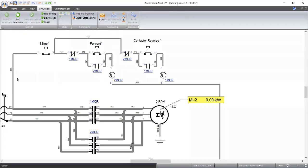So let's start now. Let me on my breaker, then forward, then energize. You can see it's jumping to 40 something before stabilizing on 3. So now let me increase the load on the motor. The torque on the motor. The torque is the load actually. Let me increase. It's on 1.6 for now.